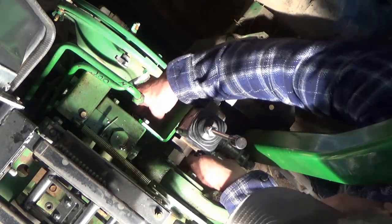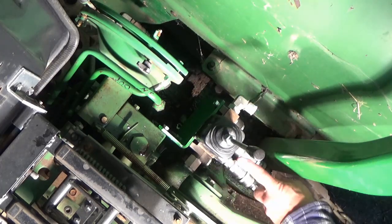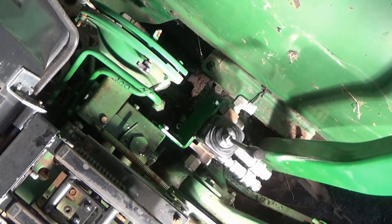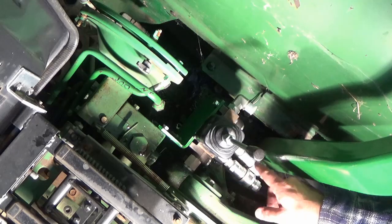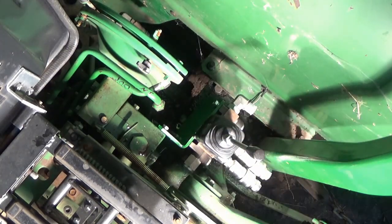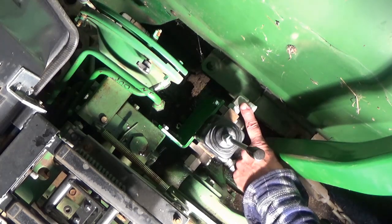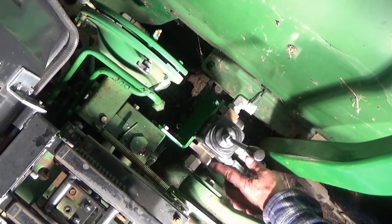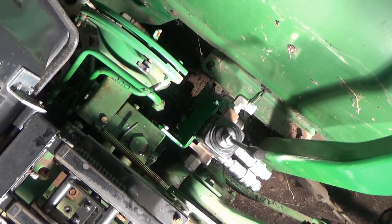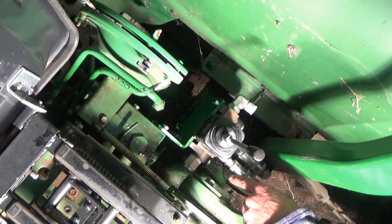Clearance is an issue here. The bolt that goes through the bottom on this side is going to need to be at least an inch longer because that boss is thicker than the one on the other side. Flipping this original bracket around backwards and drilling new holes - it actually has the clearance. I set the fender on just to make sure I'd have enough room and I've got plenty. Again, a shout out to John: you don't have to use this port, you can use this port and this front port for the bottom port as well - they're both fed from the same hydraulic. If you find yourself needing more room, use this port, and if the one down here is easier, use that one instead of the one on the side.